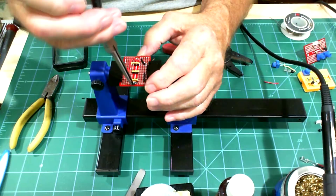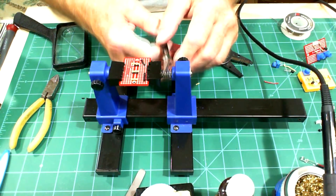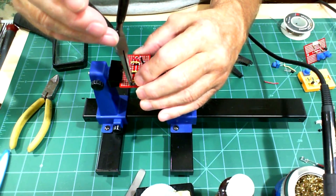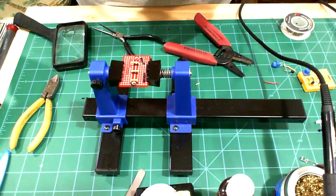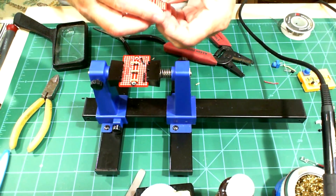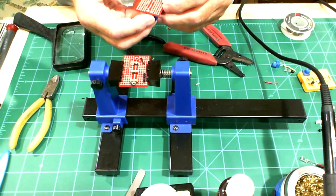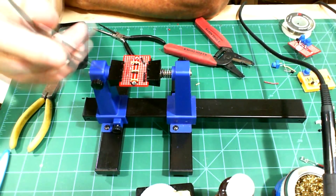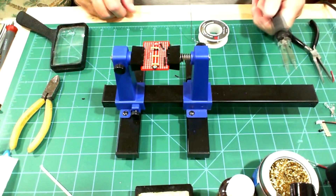On this last circuit, I bent the black wire a little bit longer and curved it to go around the mounting hole. I made it just a little bit longer so it would go all the way around the hole. I double-check with my other board: the center wiper on that potentiometer is the third one — pins three and eight. So I'm looking for yellow on three and eight. One, two, three, four, five, six, seven, eight — the jumpers are in the right place.